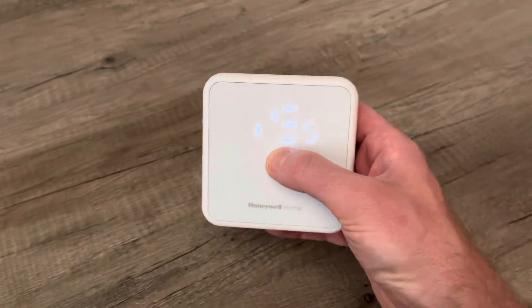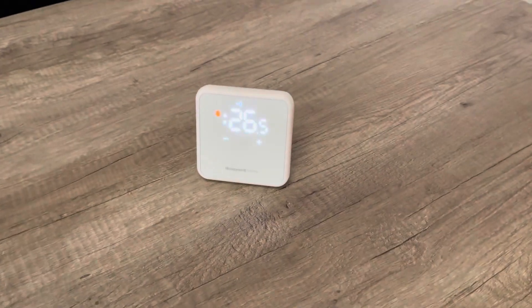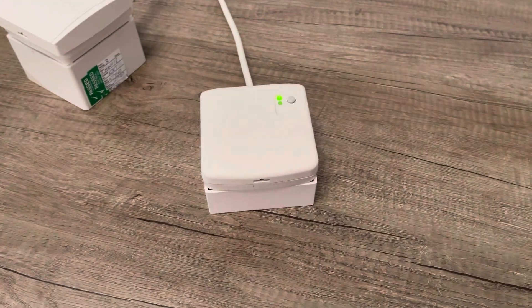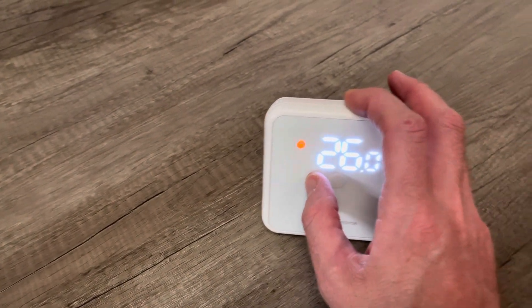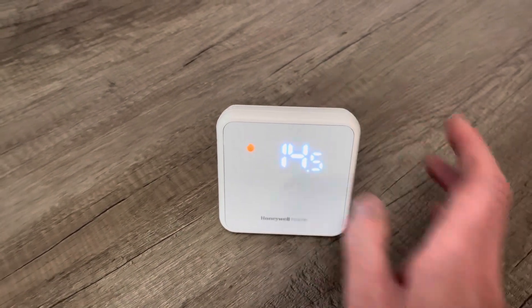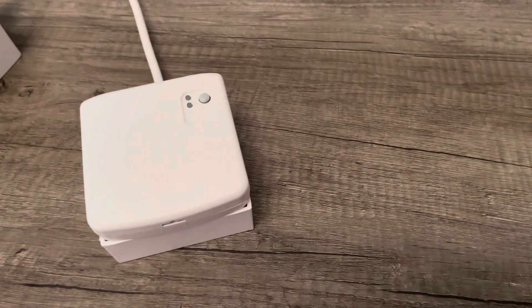To test it, press the middle button once and then turn the thermostat all the way up to around 25 degrees, then let go. It will flash to accept the change of temperature, and then your receiver should click on with a green light to show that's been successful. Then go back to your thermostat, press the middle button again, press the minus button and turn it all the way back down to around 15 degrees. Let it flash and accept the temperature. The green light should then go off — if that's happened, the pairing is complete.